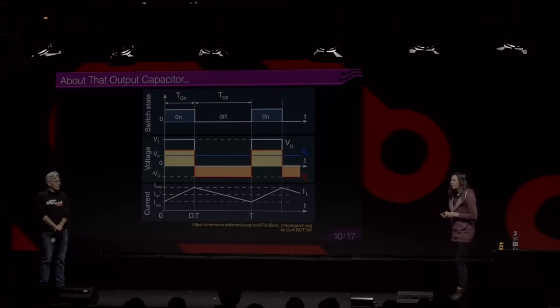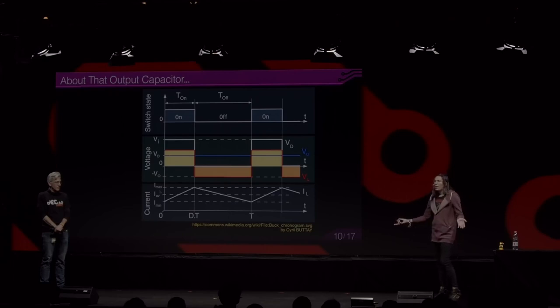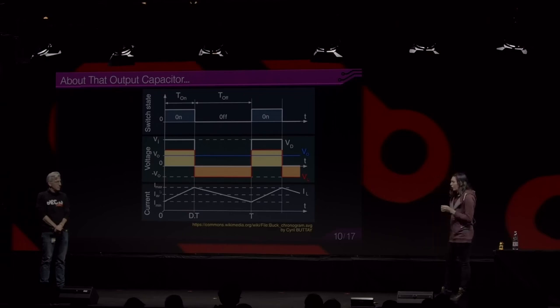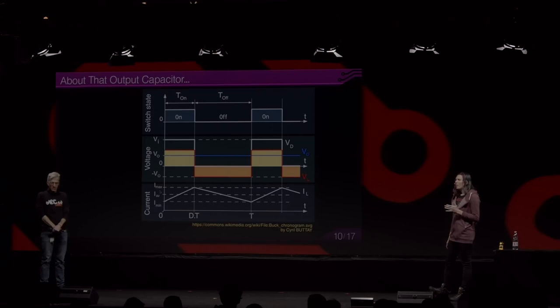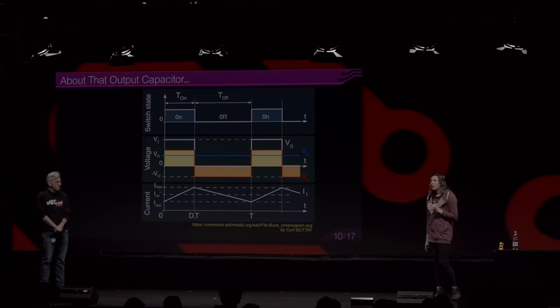And I saw quite a few converters where the input capacitor is under-dimensioned. And when you run it over longer wires with more parasitic inductance, that can create a lot of EMI. For ways of reducing the noise on the output, the best way is to have proper filtering capacitors. If you use ceramic capacitors of high enough value, you can get rid of almost all of the noise.